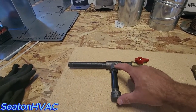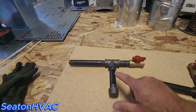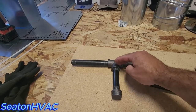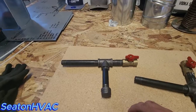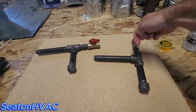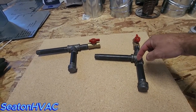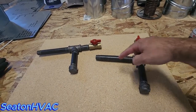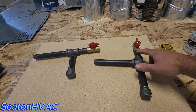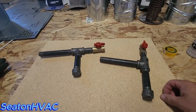Code in my area is four inches. It would probably take 50 years to fill that up if you had dirty gas. I don't think you ever need to take these caps off and clean them out, unless somebody did an improper one and they can only fit a small one in there — it's possible that sediment could build up and get into the gas stream. So what you have here is your gas coming this way: the velocity will push that debris down into there, and then the gas will continue on through the T. It changes direction — it changes to a 90. That's what you have to have: a four-inch drip leg.